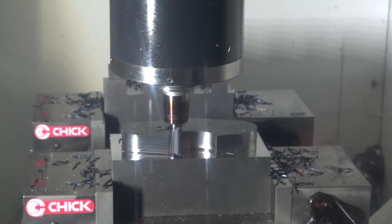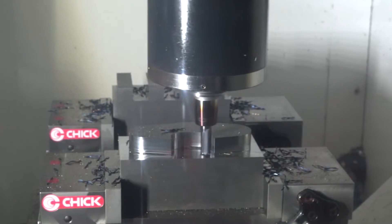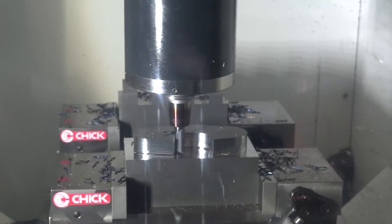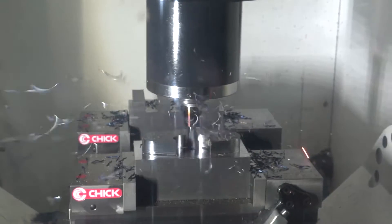Well, this is a roughing trochoidal process. We're working here with 30 millimeters deep with a cutting speed of 360 meters, tooth load 0.15 with five flutes. It was originally designed for an HSK100 spindle but you can see the Mazak machine with a DIN 40 taper copes with it really nicely — it cuts beautifully, the chips are coming away great and the tool life is also fantastic.